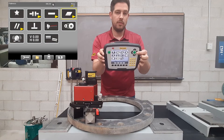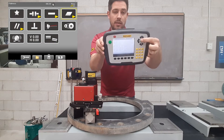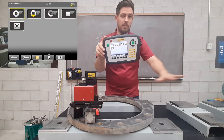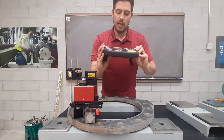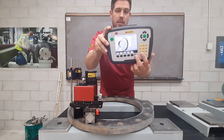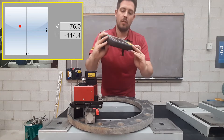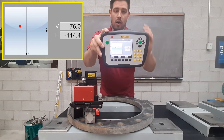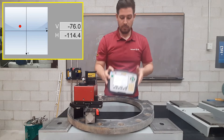Now I'm going to turn on the flange flatness program. Once you open up the display there are plenty of different programs — I'm interested in flange flatness. I'll move up to flatness, click on it, and you can see different sub-programs: partial flange flatness, basic flat flatness for measuring bases or foundations. We're doing flange flatness so I'll select the first one, and it will give me options on how to set up. First, I'll go into the detector service function button at the bottom — this allows me to set up my laser beam, which is the first thing I always want to do.